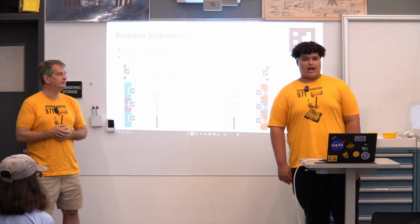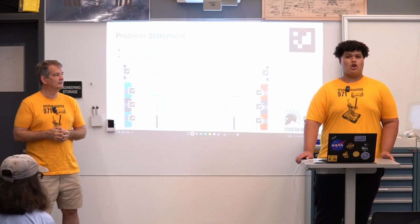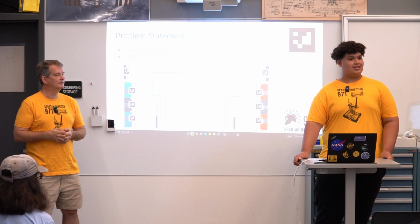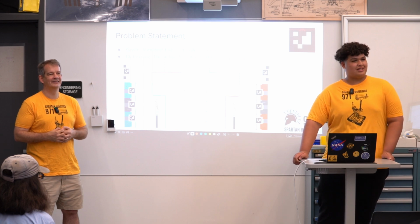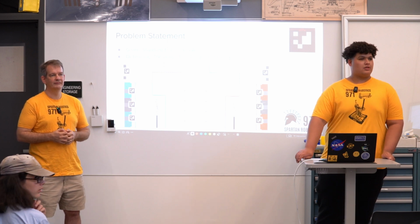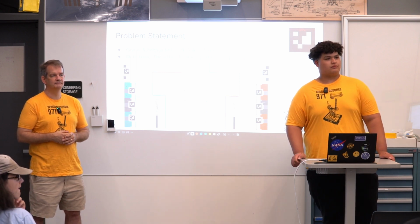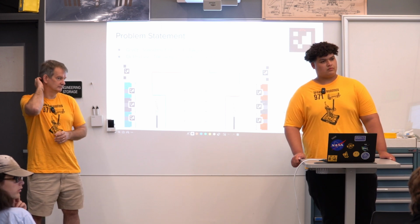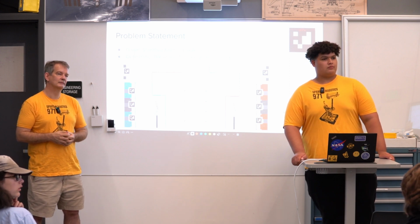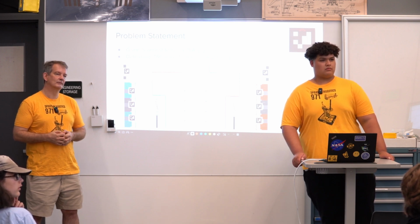Yep. And we use FlatBuffers for our data on the Rock Pis, but I don't know if we're doing anything specifically special to send it through to the Rio, besides that they're just connected together through a switch. We built a pub/sub system so you can publish FlatBuffers and subscribe to them, and we taught it how to forward across the network. So we just set up forwarding for the pose across the network to the Rio, and it subscribes and carries on. We do most of it on the Rock Pis. We'll send updates at 10 hertz or so over to the Rio, and the Rio has to fill in for 100 milliseconds or 50 milliseconds. I forget the exact rates, but then it gets a new update from the big localization system. We were running out of network bandwidth and processing time.